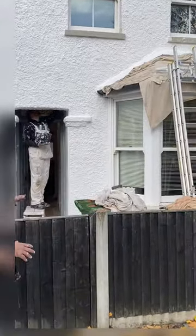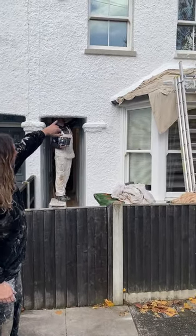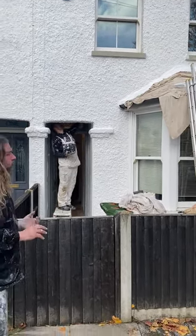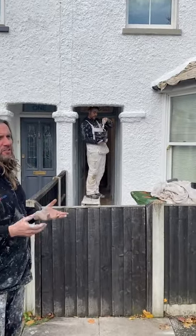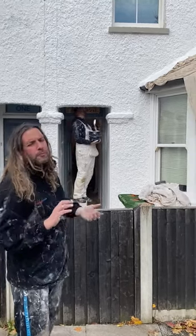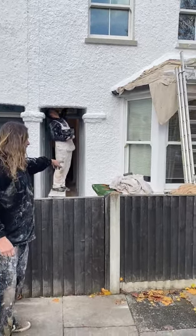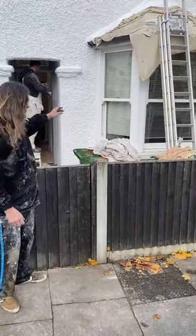So you just lay down all your sheeting. The grey that you see on the windowsills now is literally like a filler, which will be rubbed down — because there were little hairline cracks, a few little indentations, and old rubbish paint. We just literally rubbed all that back and filled it out ready to be rubbed down. The bay window has already been rubbed down.